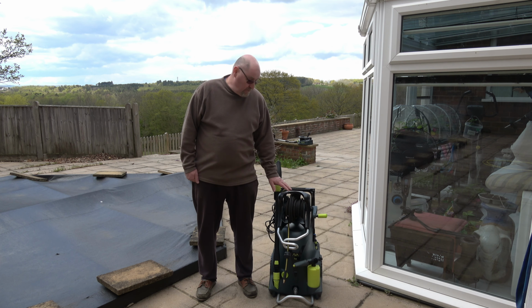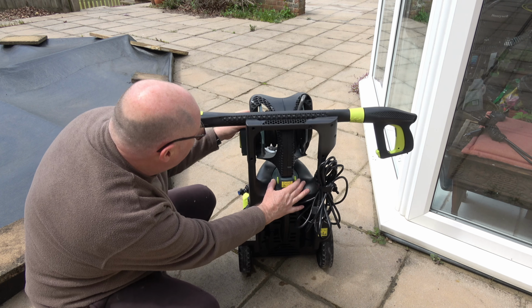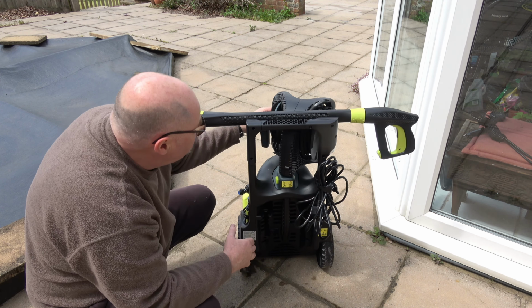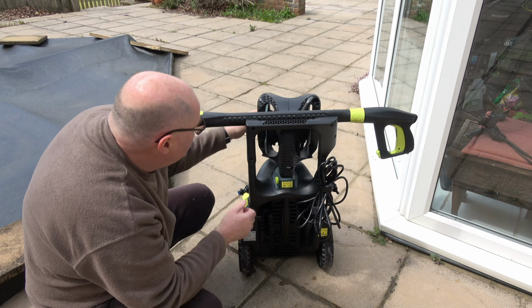And then there's a toggle here. This is for the hose reel. Now you can see that the hose reel is restricted to that amount of movement. If I press that toggle across, then you get way more movement, and it's called a follow me hose reel. So if you're working to the side of the machine, the hose reel will swing round to make unreeling the hose quite a bit easier. So in order to unreel the hose, you flip this out and then you physically pull the handle out, which will allow the hose to reel in and out.